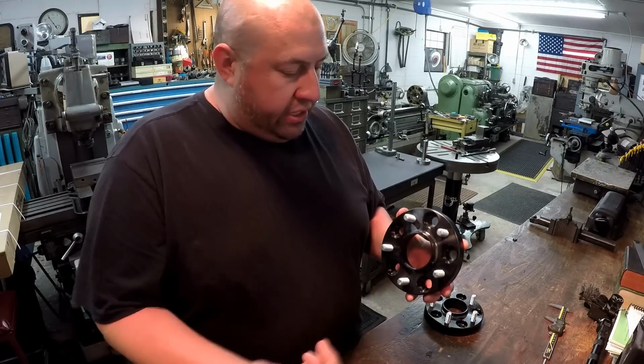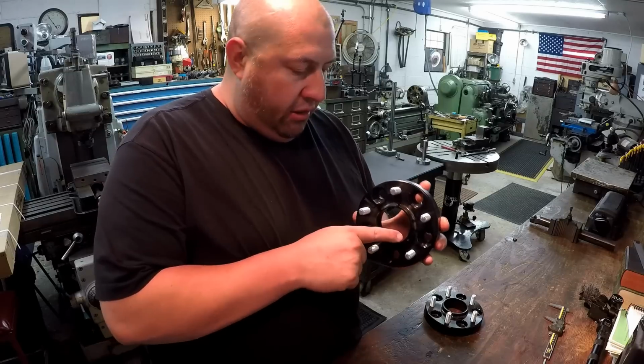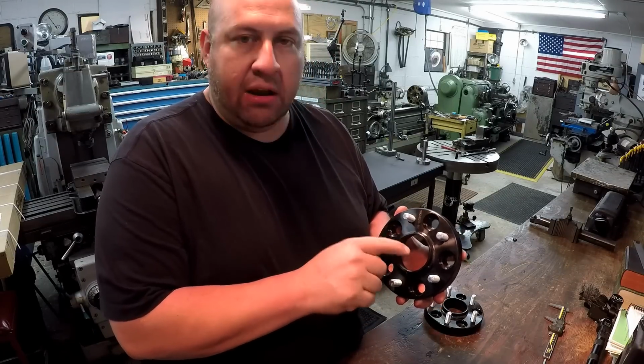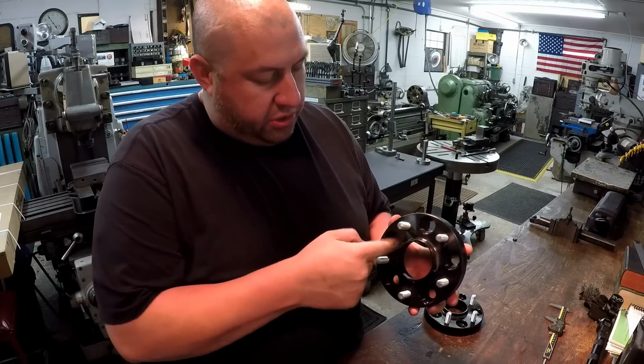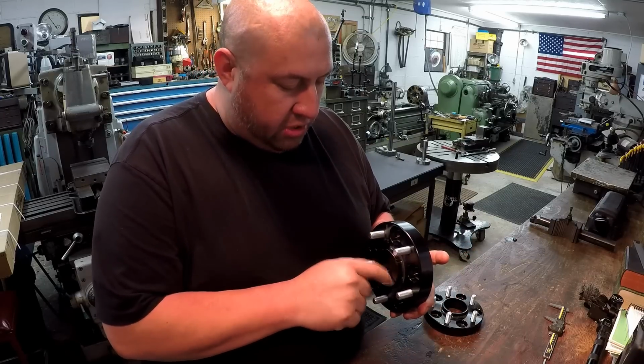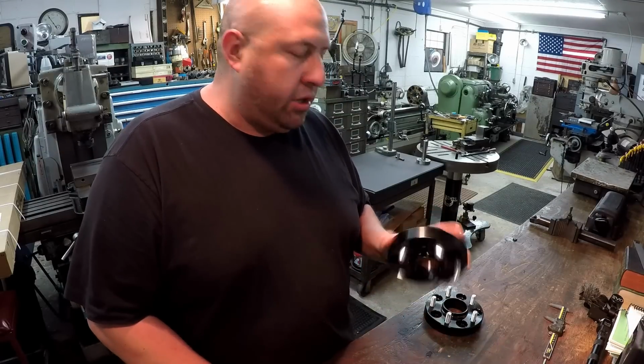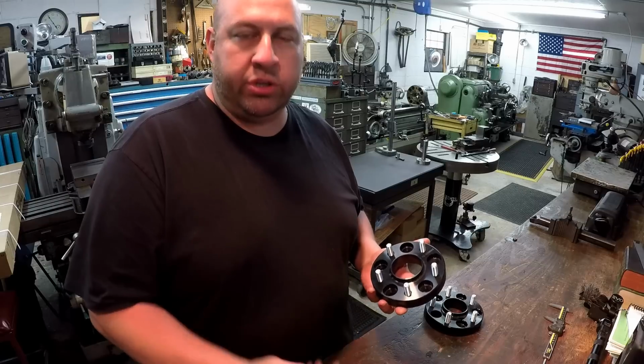So probably instead of boring it all out, there may be a little bit left in there, but I'll just come in there with a boring bar and basically just face that off till it's flush with this face. And then if there's some left in that bore, then I'll cut that out. So it's a pretty simple op, and I'm going to use the new Gator chuck, 3-jaw chuck for this job right here.